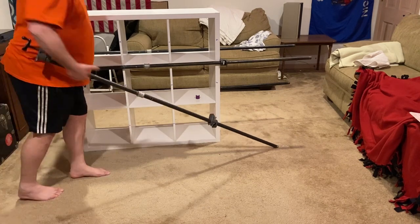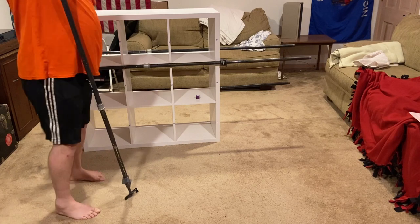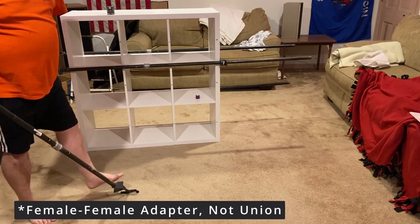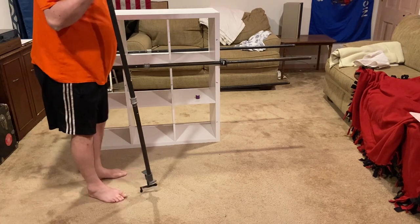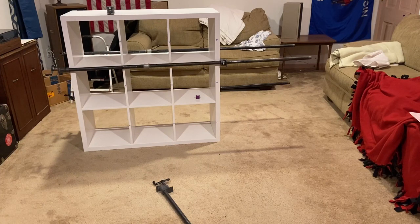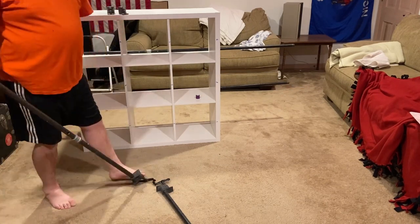I left this in as I thought you might find it interesting how you can store a 6-foot long pipe clamp easily. You put a union in the pipe so that you can change the length at will. All my pipe clamps are 2-foot long, and then I have 6-foot long extenders, so I can make 8-foot long poles if I want. In fact, I can keep stringing the extenders as long as I want. This makes it really easy. I can thank Mr. Father for that one.